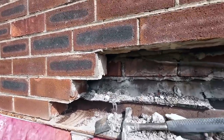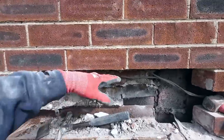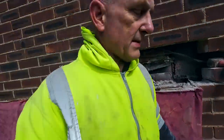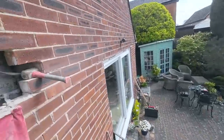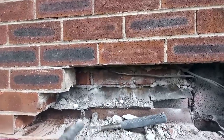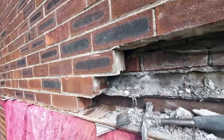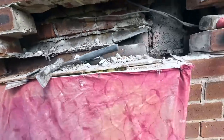I'm going to get a couple more out, get this Acro in and then carry on. I'd get the grinder in and take this joint out because it goes right through, but I can't physically lift it up at that height, you see how high it is. Holding the grinder up level, if it catches, it's a bit dangerous. You need to scaffold up another 3 foot to keep that safe. It'd just save a lot of chipping anyway. Anyway, that's enough waffling. Let's get you set up somewhere on time lapse and you can carry on watching.